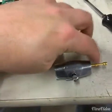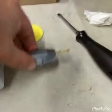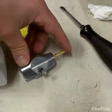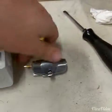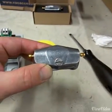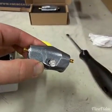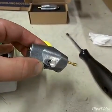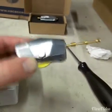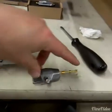A lot of times this rod in the spool valve will get gunked up, so you can remove it and clean it with a non-residue cleaner. It should go back and forth pretty easily. To test the function, hold it horizontal and start tilting it — at about 20 degrees it'll start slipping out on its own weight. That way you know it's free of debris and operational.